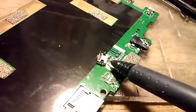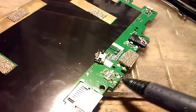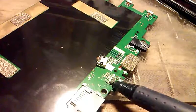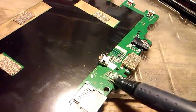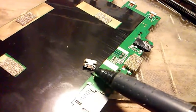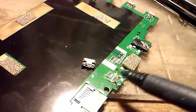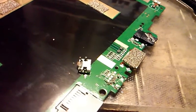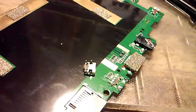What to do first is clean off all the solder where the casing of this thing goes. You see these little legs right here — they're supposed to stick in these holes and we need to clean those off, that's our main structural support. In this case we have the luxury of having these test pads right next to the traces that fell off, and we're going to be able to solder to these little pads right here. First we're going to clean these leads off and solder a few little pieces of magnet wire on there to make jumpers, all the way over here. You're not always going to have the luxury of having these little test pads right next to the board.